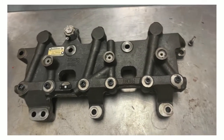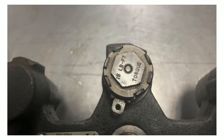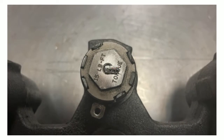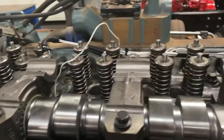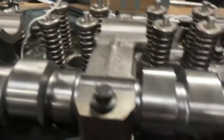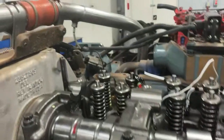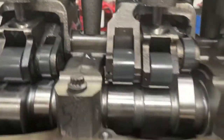Troubleshooting these things if the brakes on a truck aren't working is fairly easy. The manufacturers put a button on the top of these solenoids, and most different brakes — even if they're not Jacobs — use a similar type of solenoid. I showed you the jake brake housing on the table; this is where it mounts on this Detroit Series 60 engine, right here above all the valves. We took off a lot of stuff here including the rocker shaft for teaching purposes.